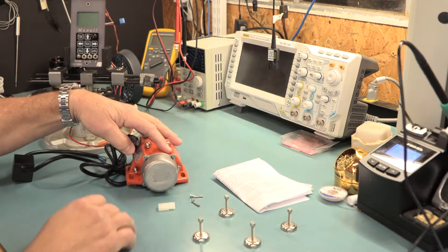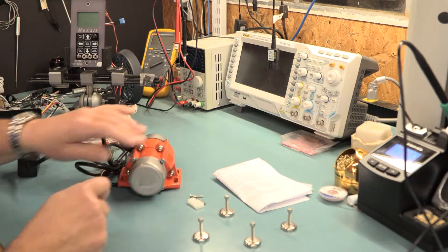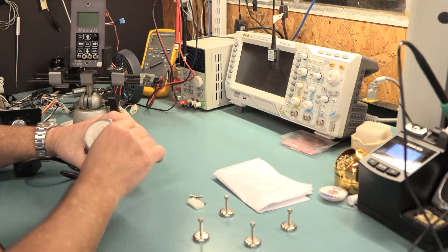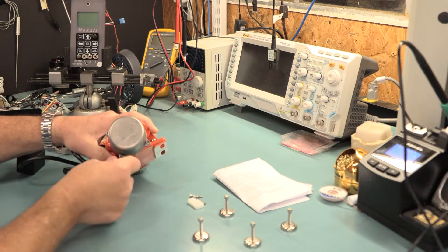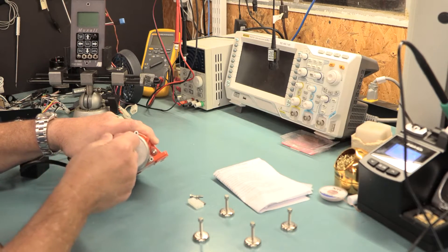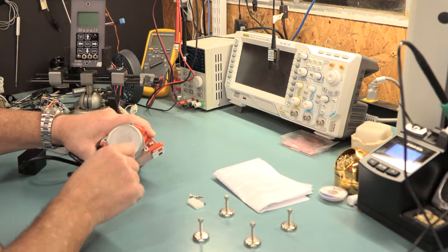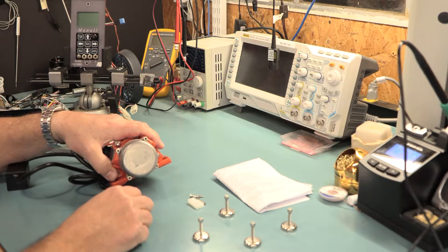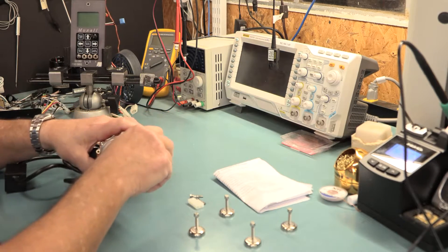Another thing you have to do with the kit is pull both ends off and adjust the weights inside. You need an allen wrench for four screws on each side. You have to do this because they come default at 100% vibration — and I'm telling you, you can't hang on to this thing at 100%. It's designed as a concrete sift shaker, and the magnets will jump off the grill quickly. Adjusting this is a must.